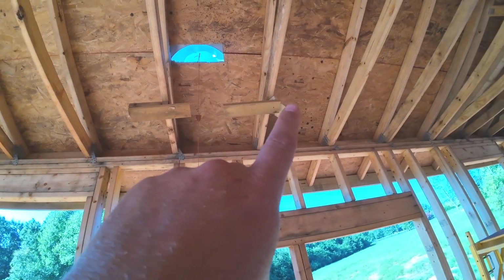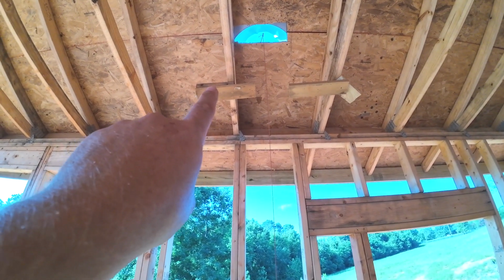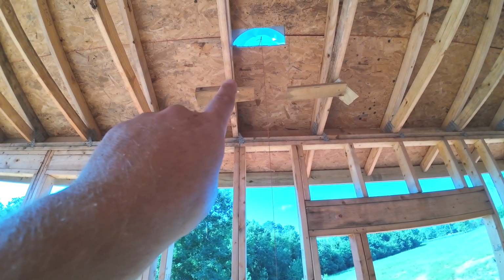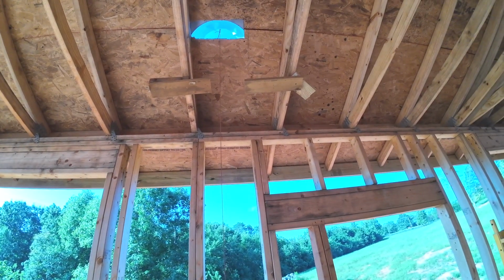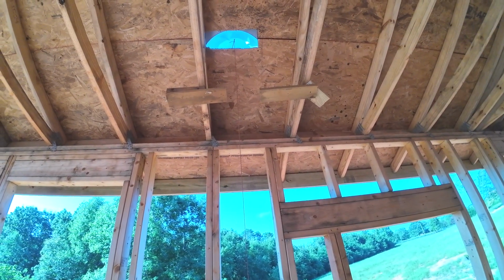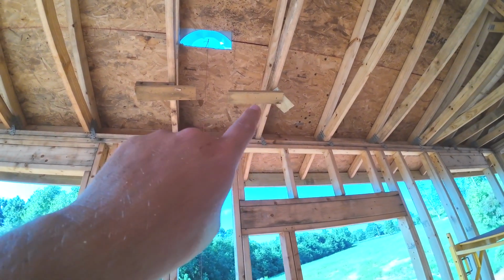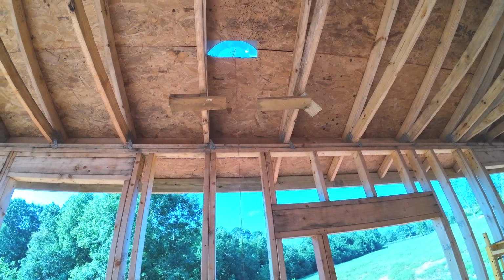I put these little guys here to give me a reference point. The box is supposed to be 2 inches below. Actually, I need to do that over. I think it's 2 inches below the drywall, and right now I only have 2 inches, period. Alright, so I need to redo that idea. Maybe 2 2x4s instead, that'd put me at 4 inches. Yeah, that'd probably be more accurate.